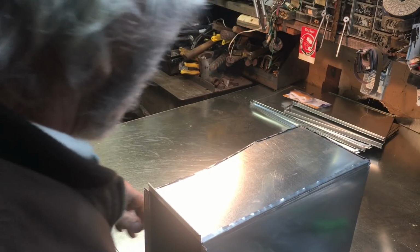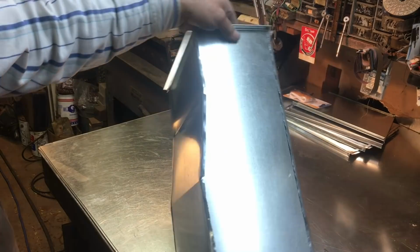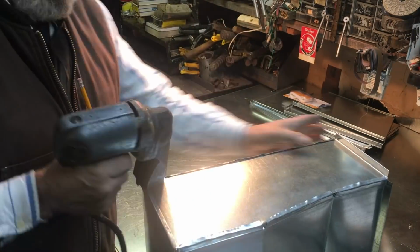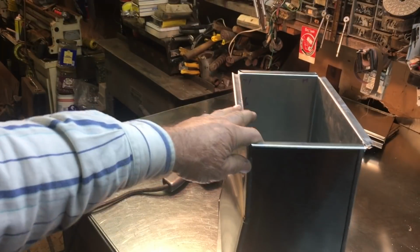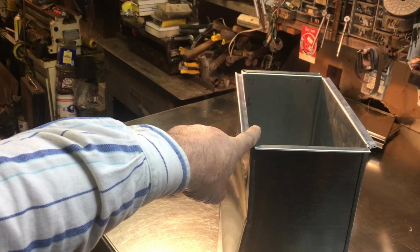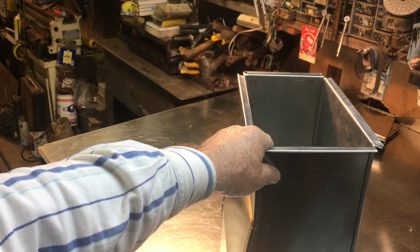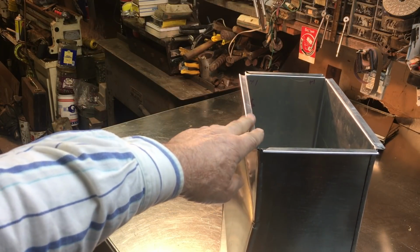Now remember this old boy here? See how nasty that looks? But you just get that bent over in the general direction, then you dial it up. Now again, what that's going to do is encapsulate that torpedo boot where it cuts off right underneath the floor, made a little bit larger so it'd be very simple and gets him a little bit of adjustment in order to encapsulate it, to make it easier to take the 6-inch tap off the bottom to go to the new register.